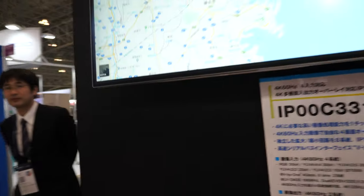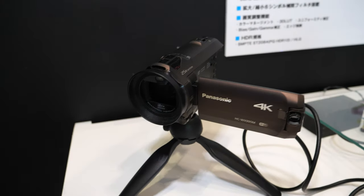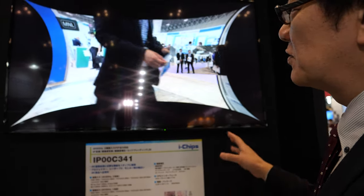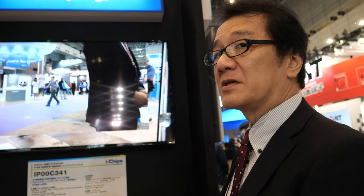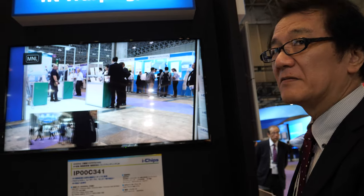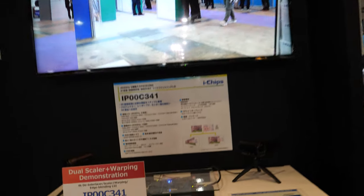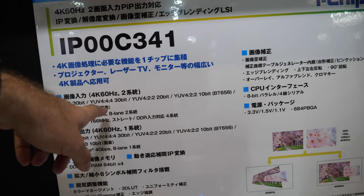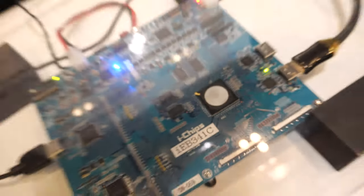Here's another demo with a Sony camera and a Panasonic camera. We have picture-in-picture and we're doing image warping using the C3861. Performance is 4K 60 — our chip can handle 4K 60, though this camera is only 4K 30. You can take 4K 60 and warp it in real-time. It supports 10-bit, 4:2:2 and 4:4:4 color. It requires an external CPU interface via SPI.